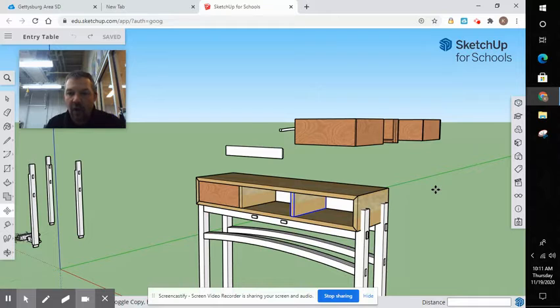So all you really need to do is take your measurement of your casement, inside measurement left to right, subtract 1.5 inches from that. That's your 3/4 here, 3/4 here, and then divide that by 3. And that's going to give you how wide these drawers need to be. So you'd measure that length, throw your first divider in, measure your next length, throw your second divider in, and now you have 3 equal bays.